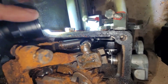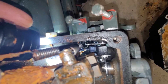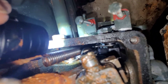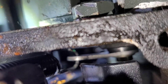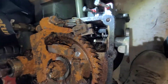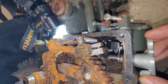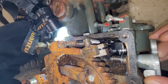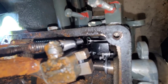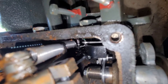It's possible that could get bent and it won't work — it'll bind up really bad going in and out. It acts as a guide on that side, and then the guide on this side can also bend and not guide properly where it goes through the throttle governor linkage. So there's a lot of stuff that can get bent and damaged. It's critical. There's kind of a lot going on in there, but once you understand it, it is relatively simple.